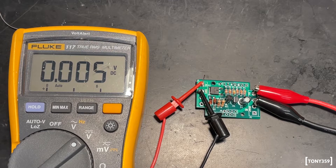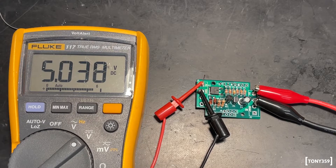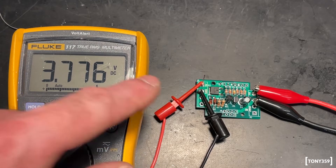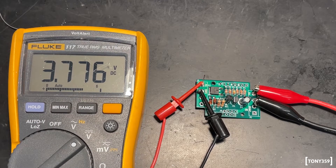Amazing. Trying 7V, 8V, 9V, 14V — the power supply is doing 15V at 15.2V and I have no output. Going back down to 5V, my output comes back. It works pretty well. I like it. Now I want to try adding a load on the output just to simulate some kind of load and see what happens, and make sure it behaves with a load connected as well.